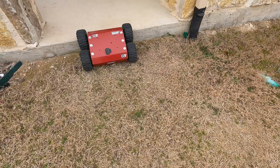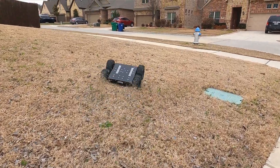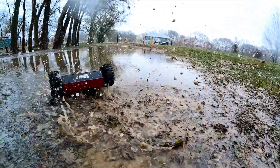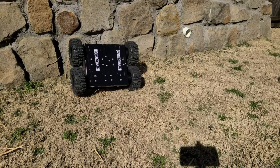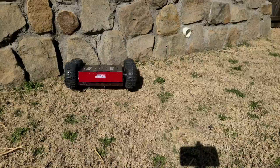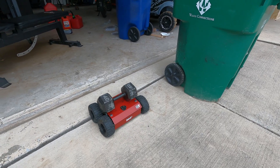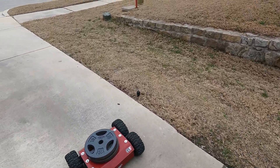It did have a lot of trouble going upstairs — it would just flip itself over. Both stairs and small curbs were a problem, so if it wasn't sloped I was probably going to end up on my back. Actually, even just sitting still, if I hit the throttle hard this thing would flip itself over. For payload testing, I threw one of my 40-pound dumbbells on there — it could move but it couldn't go over anything because the slipper clutch would just slip. With 20 pounds it was relatively unaffected. But this is kind of a useless test because it is so dependent on how I set up the gearing and tires initially.